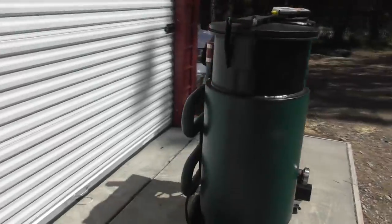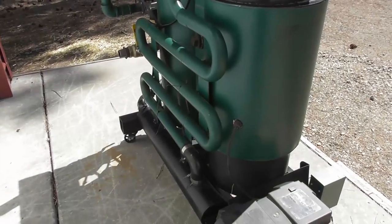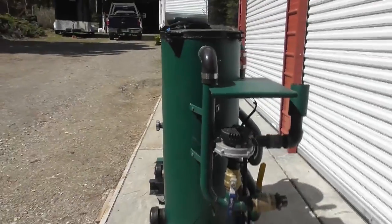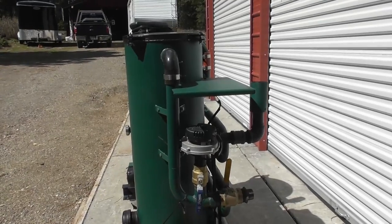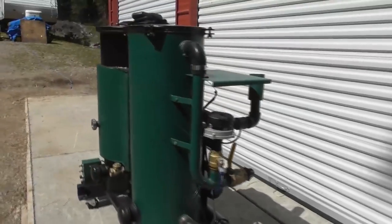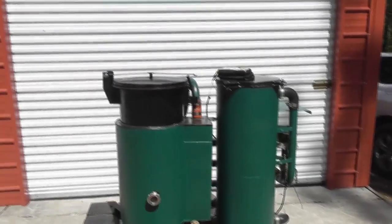As we look around the back, you'll see we've got the cooling assembly. And then coming down on the bottom there, we've got the condensate tube. Coming around on this side, we've got the filter tank with the filter basket inside. We've got the gas exit assembly that contains the blower that takes the gas to the flare. And then we've got the secondary output that's going to go to your secondary application, which could be an engine or a vehicle. What we're going to do is go through each sub-assembly — start with the base, work our way through, and save the most complicated for last.